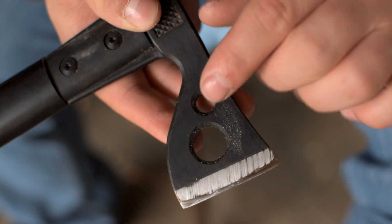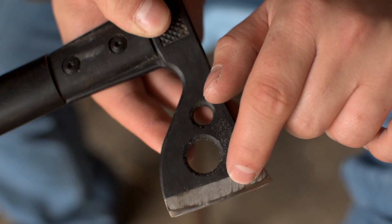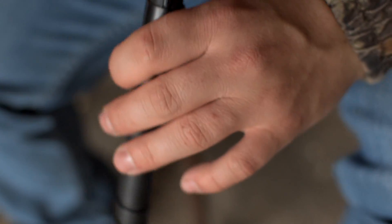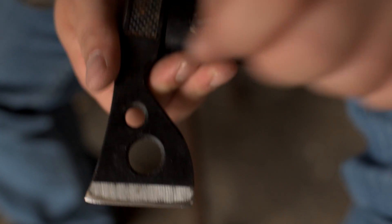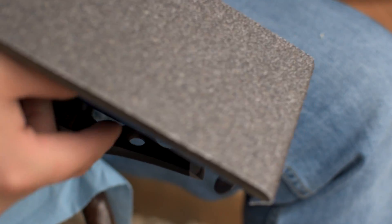What you can see I've done is I continued on that microbevel until I got all those chips out, and then I recessed that microbevel. So instead of that little short microbevel it was on the start, you can see it's much longer now — I thinned out that bevel a little bit. And now we're going to continue on in a much easier way than even with the file, and keep cleaning up that bevel. What we're going to use to finish this bit is sandpaper.